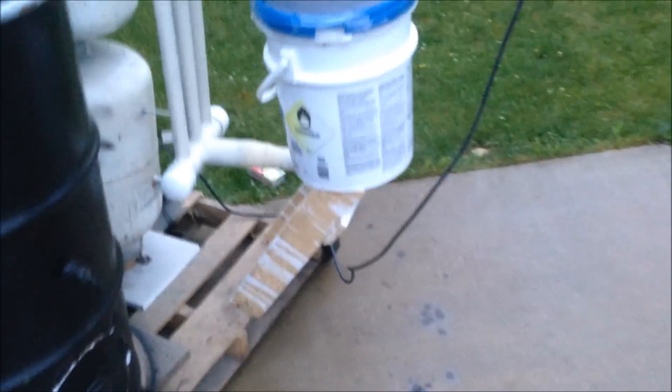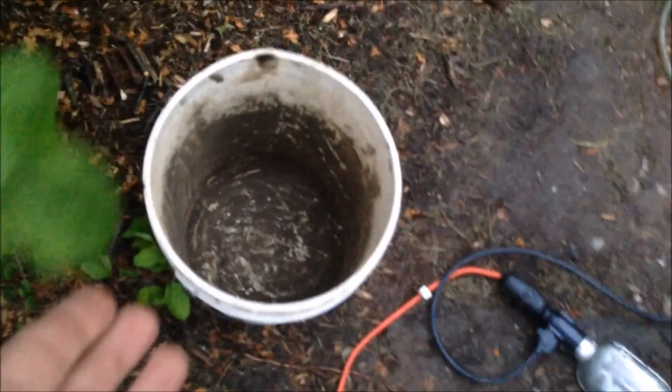I'll give you a look down inside the hopper because I'm fresh out of fuel. It's all coals down there - just in the reaction zone or combustion zone. Nothing in the pyrolysis zone. That means I've got nothing feeding my syngas production, and I literally have no fuel left to burn. None left in the bucket - I put it all in there.